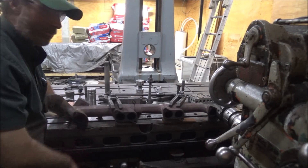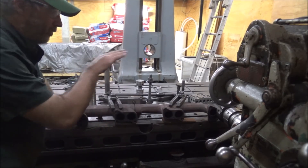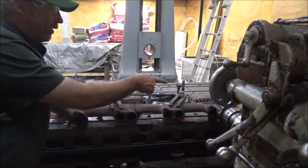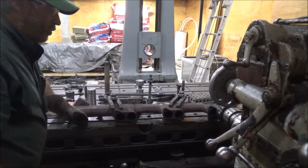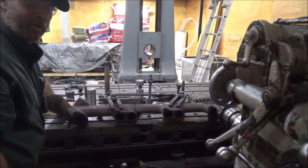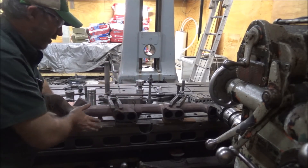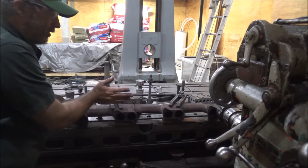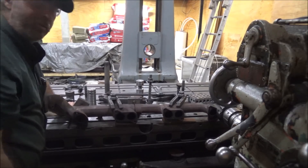So that's the method I'm using this time. We'll see how that goes. Maybe this will be a little faster setup than it was before with all the stacks and the multiple clamps and arms and jacks. Going by the face mill there, I can tell this is slightly out of square still, so I'm gonna have to loosen these clamps, tap these jacks and get it squared up, lock it back down, and then indicate these faces and see if it's parallel to the table, if the stop blocks are doing their job or if I need to turn all these screws in to get this thing straight. And then it'll be time to make a cut.